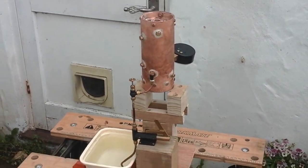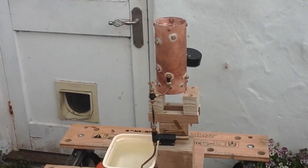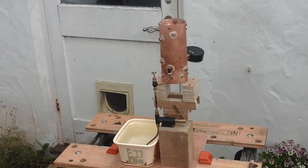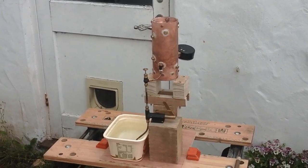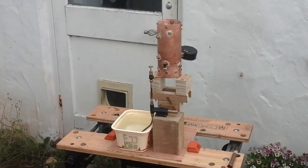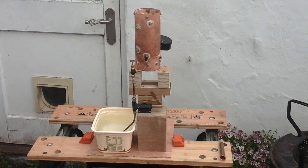That open bush on the top left is obviously to let the air out while I fill it with water, and then when it's full to the brim I'll put another blanking plug in there. The pressure gauge is that black thing at the back. Unfortunately, when I tightened it the dial ended up facing downwards. I could have shimmed it with copper washers to make it face a more convenient direction, but instead I've got a square of mirror tile so I'll just sit the mirror behind it and read the pressure gauge in the mirror.